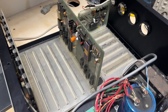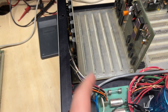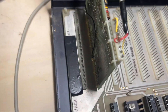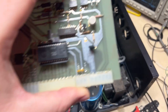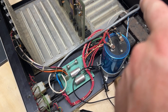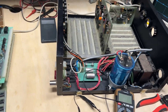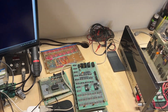Got the CPU card and one of the 4K cards with its address jumper set for the lowest position, and one of the two serial cards placed in slot one — the control card slot. This one is jumpered for 1200 baud via the user-defined pin, which is wired to the baud rate selector on the front, also set for 1200. With a quickly assembled serial-to-USB cable, I've got TeraTerm running.